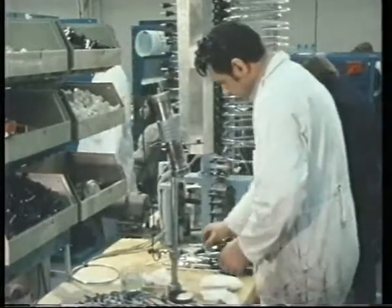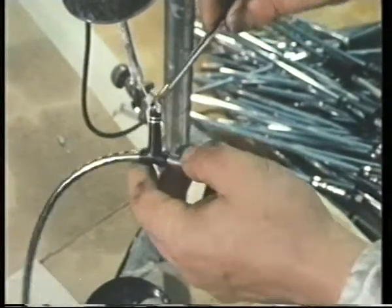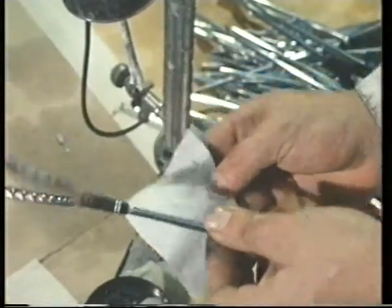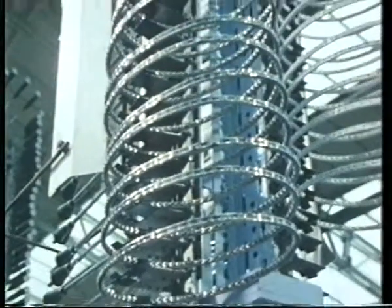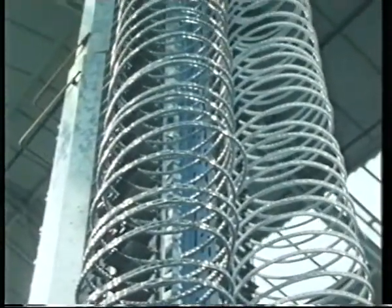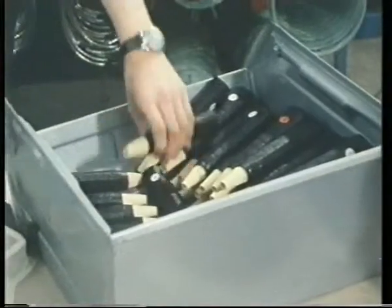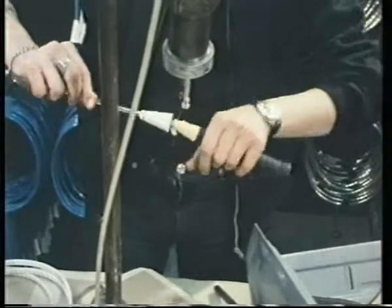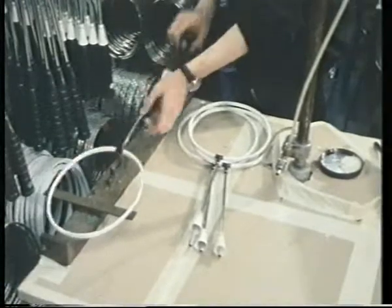In this factory, badminton rackets are assembled using a thermosetting adhesive. The adhesive bonds a steel shaft to a T-piece made of an aluminium alloy. As it's a thermosetting adhesive, the joint must be heated to create a strong bond. Here, the racket travels up slowly between 2 infrared heaters. To join the wooden handles to the other end of the metal shaft, the same adhesive is used. The handle is pushed home and then put on one side, ready for heating.